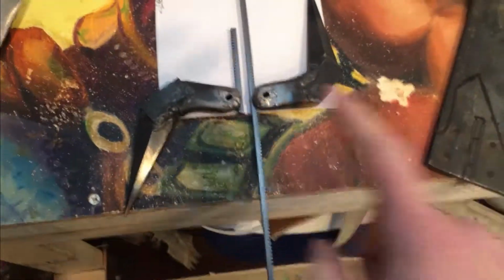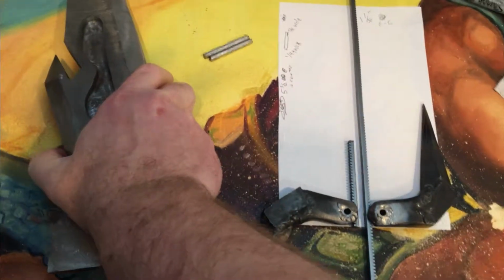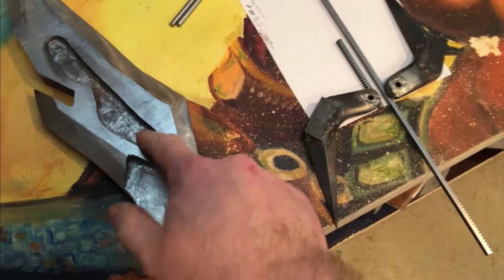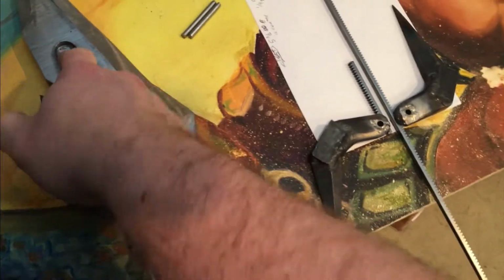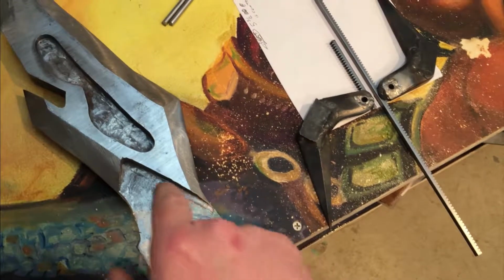So now I'm going to build a test plate. This is way thicker than 1/4 inch. This is pretty close to 3/8. And I left it thick because, well, one, I don't have a mill, as you saw in the earlier video. This part here, the fuller die didn't work out, so I had to grind it all out. My press isn't strong enough to push that big of a shape into hot steel. And this I did with a die grinder.